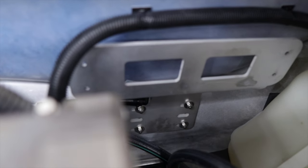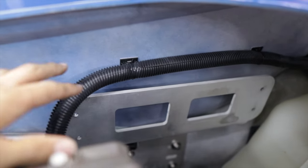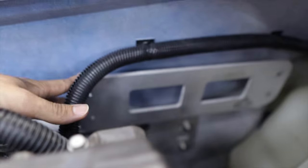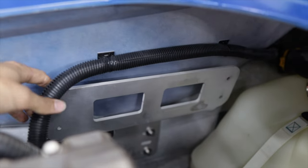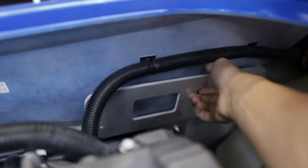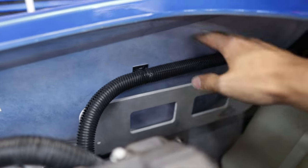A couple of things I forgot to mention: the bracket for the intercooler is slotted, and I find on the new GPs you have to slide it all the way back to have enough room for the intercooler itself. The water line exit hose coming off of the oil cooler has to be secured — from the factory it's secured to the stock bracket, and the Riva instructions want you to zip tie it back to the new bracket, but I don't think that looks as clean. I use these zip tie tie-down points with two-way tape — overall much cleaner than having a zip tie holding it in an unsecured spot. This is something I recommend, but now we can move on to the intercooler itself and get that bolted up to finally finish this ski.